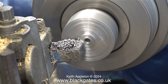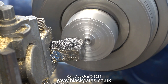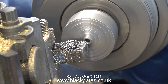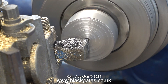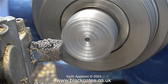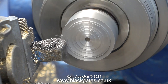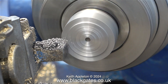I don't mean square as in not round — I mean square as in the angle of the front face that I'm machining relative to the longitudinal section of the piston. Here goes the last bit and the piston is nearly the size that I want it. One particularly good thing about using this Smart and Brown lathe is that I don't have to endlessly wind the top slide handle. It has an auto traverse both longitudinally and transversely — the top slide moves all by itself, as if by magic, all into a gearbox system within the saddle.